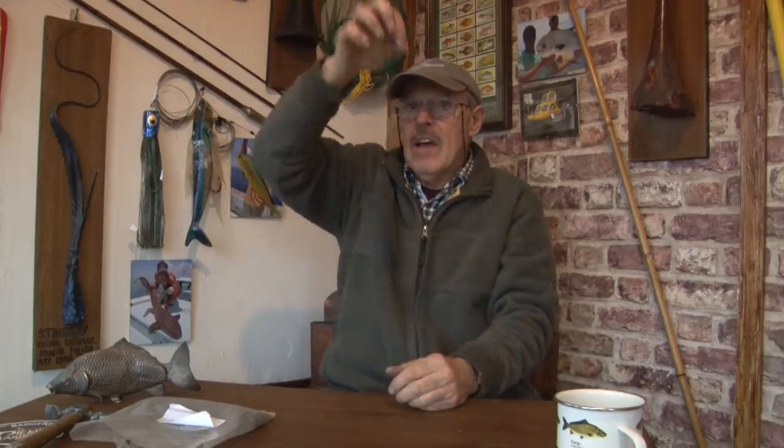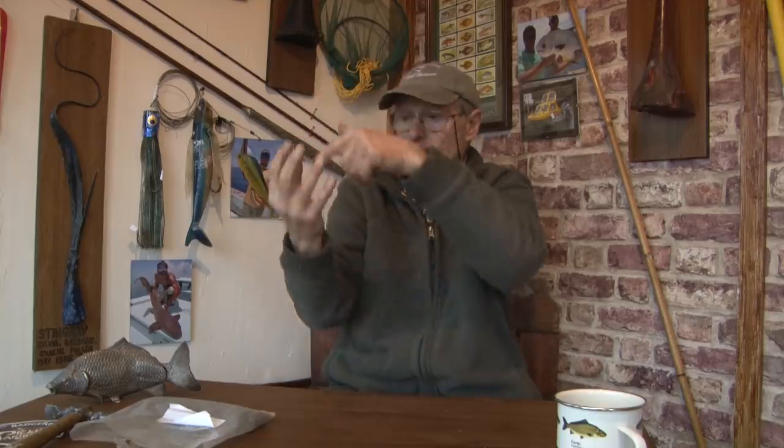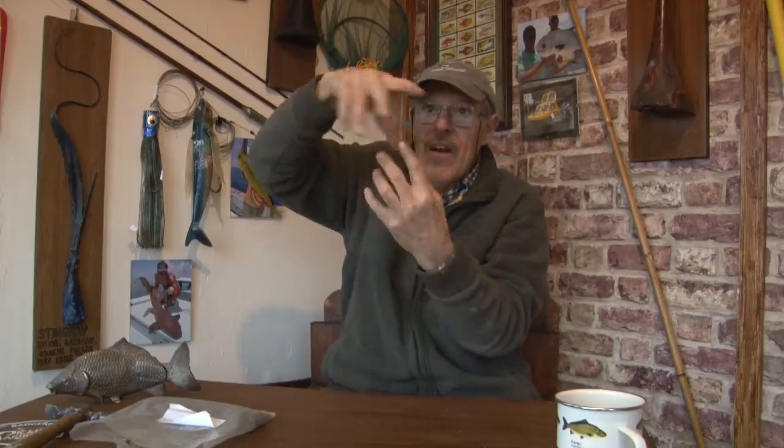But a job I did do in the summer, which was one of you guys out there commented, I had trouble with my weather vane turning. Because obviously I'm a fisherman, I'm always looking at the weather. Here we're pretty well exposed to west, southwesterlies and southerlies, shelter of a northerly. My weather vane wasn't going out, and then somebody said, I mean, it's so simple, it's ridiculous. He said, get yourself a stainless ball bearing, Graeme, take the weather vane off, a little bit of grease or oil on there, put the ball bearing over the top or in the tube so it goes back over, and it swivels because you've got a reduced area of friction there.